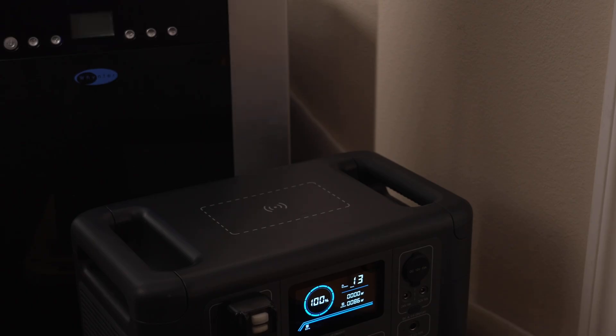Perhaps the most impressive thing about this unit is its 1500 watt inverter — it packs a huge punch for the price and battery size. I would only have expected a 1000 watt inverter. The marketing materials claim 3 kilowatts of surge power for one second, so I tried powering my 14,000 BTU portable air conditioner, rated at 1250 watts — well below 3000 — but it surges up to 2.5 kilowatts when the compressor engages. This caused the Dino X1500 to choke and the compressor never engaged.